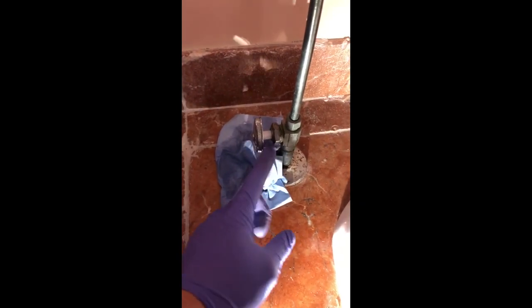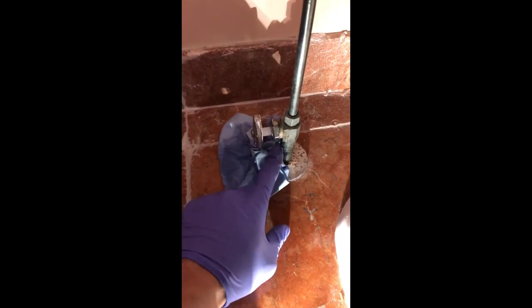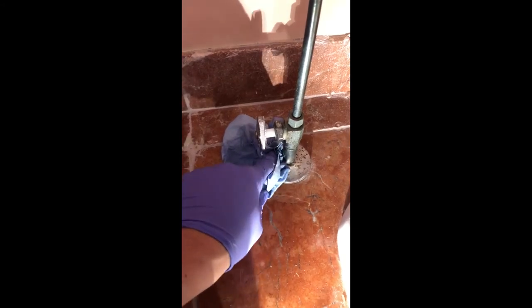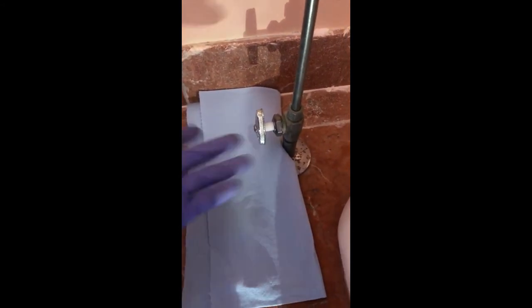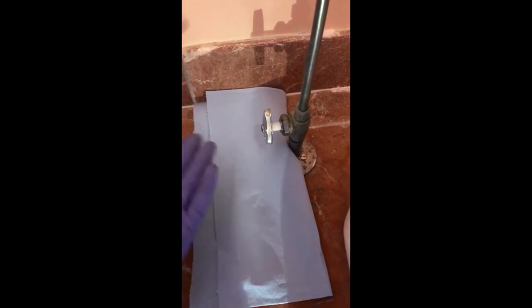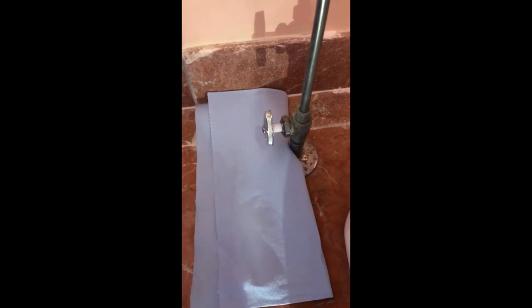That's just a little tip I do for all the valves in my house. If you do get a slight leak from the stem over here, that means that this nut isn't tight enough — it hasn't seated on the gasket yet. As I run my finger around, you can see a little bit of water there. It's just from the valve going in and out of the gasket itself. As long as you're not getting a lot of leaks, you should be fine. The way I check over the next few hours is I just put a new paper towel right here. If the paper towel is dry over the next day or so, that means your install was fine.